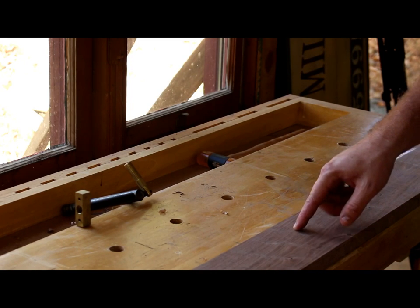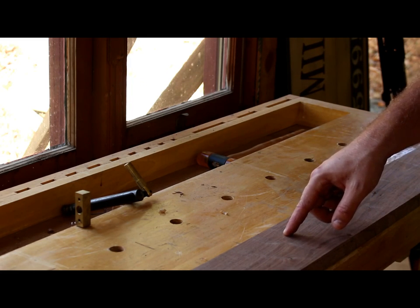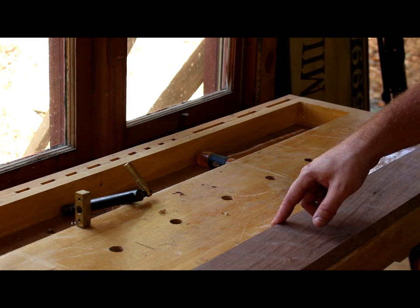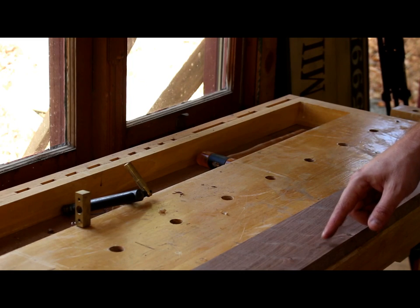Lined up here on the workbench at 4 inches wide, and the length is 52 inches, this is the long end of our aprons. We ran it through the jointer, then we ran the other end through the table saw to true it up. Now, what I like to do on these aprons is run a little groove at the bottom. I think it looks good when you approach a table and you see this little decorative groove on the apron.